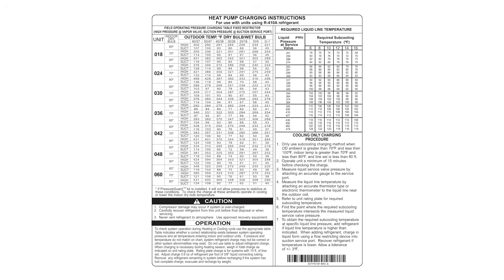When you're using a chart that asks for both, like this one, it has a dry bulb and a wet bulb reference on the top. The outdoor temperature is dry bulb slash wet bulb - that first number is dry bulb, the second number is wet bulb. It's better to use and reference the second number because that takes into account what we call latent load or evaporative load. Now in heat mode, your evaporator is outside. That coil that used to be your condenser is now your evaporator, and therefore humidity matters - the amount of moisture that condenser collects is proportional to the relative humidity outside.